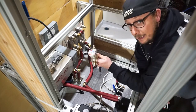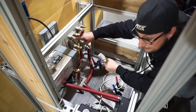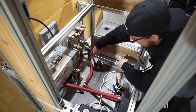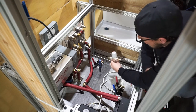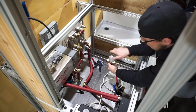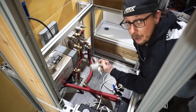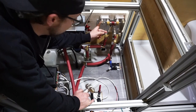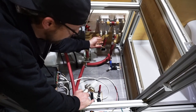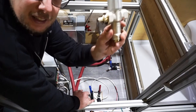The plan for this week is to get these mixing valves installed. They come off our heat exchanger plates, run through and give us our hot water to our shower lines as well as our sink lines, and get them all set up so they're accessible so we can set the actual water temperature that goes to our shower and our tap. I actually thought this was gonna be a really easy task of just joining our PEX lines, crimping them on, and mounting this all in place so that it's accessible.